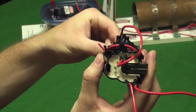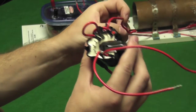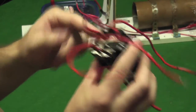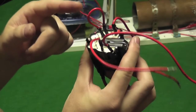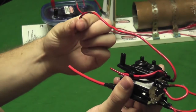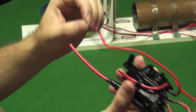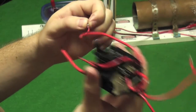As I found on this flyback transformer and a couple others, some of them are actually required to have certain pins connected together in order for it to work. In order to figure that out, I submerged it in oil with the primary input, ground, and high voltage connected and tested it, because the oil would properly insulate all of the pins and stop them from arcing. The results I got initially were less than significant, so I took it out and tried again. I noticed that two pins were actually arcing together when the high voltage would arc, so I soldered them together and the results after that were much better.